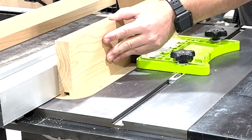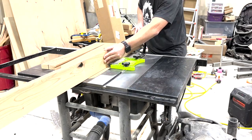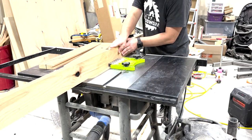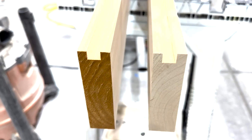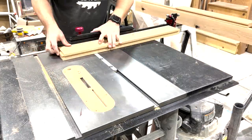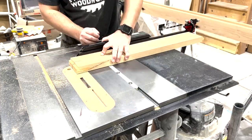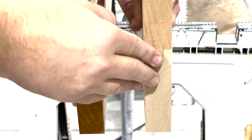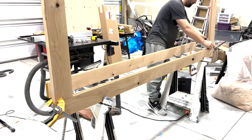There are two purposes for this dado: one, it's where the interior panel of the door is going to sit; and two, that's going to be the size of my tongue for my rails. Ideally, this dado sits dead center, or one third of the thickness of the rails and stiles. These dados give me an exact reference of where to cut my tongues on my rails. It's always a good idea to do test runs on scrap pieces before you cut tongues and grooves, just to make sure you have the right settings. You might see a little gap there, but that's going to allow the glue to set in and make a really nice tight joint.